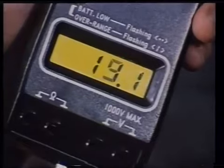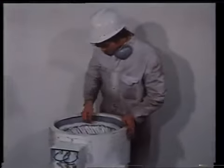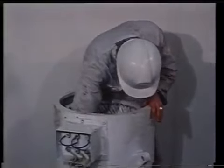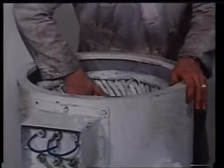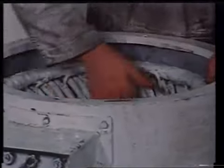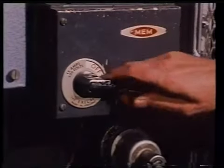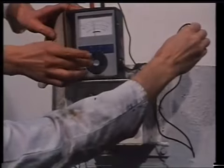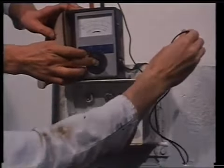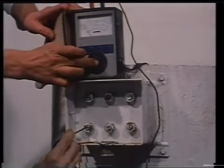Adjust to just below the full load current of the motor, carefully checking that neither the motor nor the welding set will heat up too much. This is most important. Continually check the temperature and adjust the current accordingly. Run this current injection for about 15 to 30 minutes, checking all the time the heat condition of the motor and the welding set. Switch off and recheck the insulation resistance readings to earth and between phases. Several heating cycles may be needed before the readings will rise above 1 megohm.